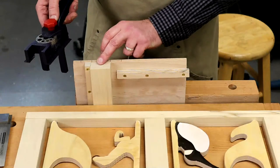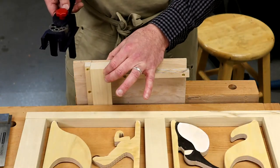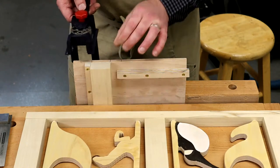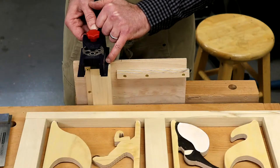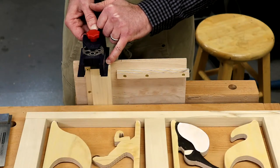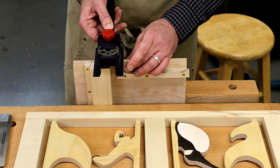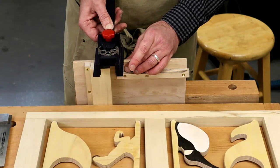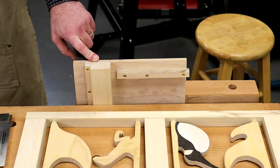And once that's set, because we have that thickness of the ply to consider, we need to set that on our center line, so the tooth on our zero mark on our doweling jig perfectly aligns with that center line, and it will do it on both ends. Okay. Now, the reason I made this jig was to make it repeatable,